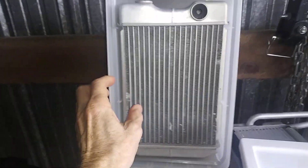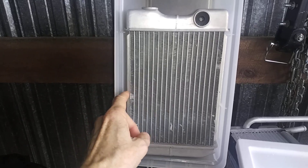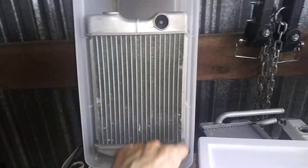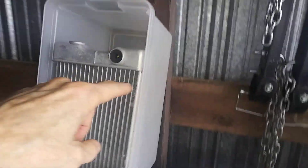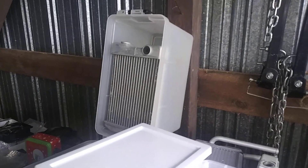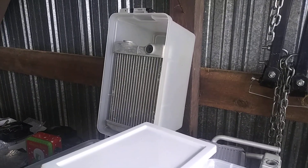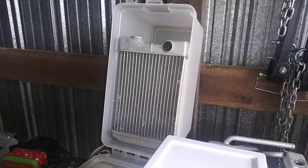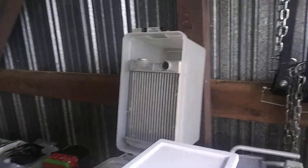The battery box was probably about this tall, so I'd put about one inch of foam at the top, one inch at the bottom. The black battery box was probably two inches wider, so I had a blue strip down the side and all the way around. On the opposite side of the box I cut a hole and put the fan in there. I used that design for about three years off-grid in Texas where it was really hot and humid.